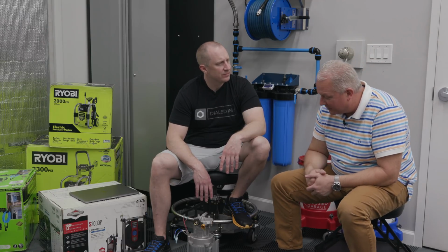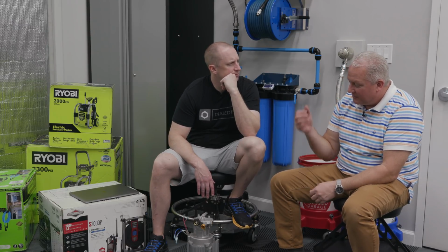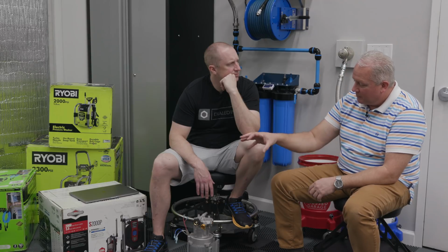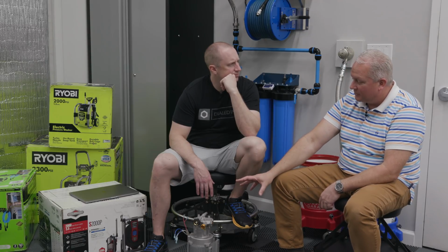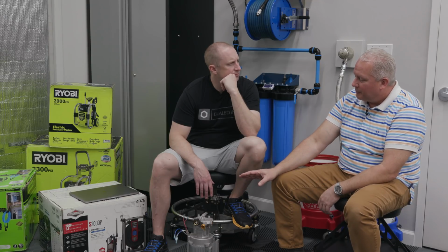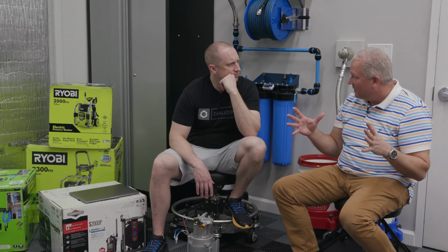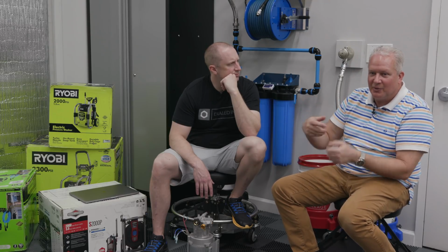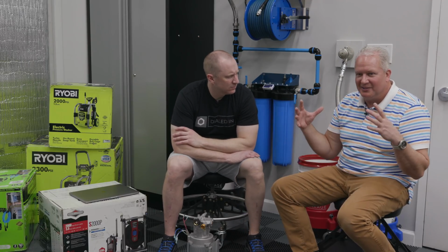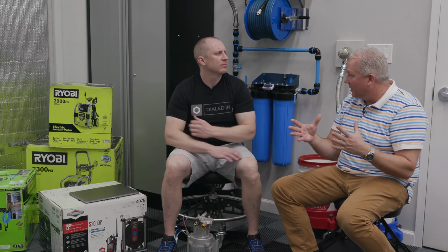Yeah, absolutely. It's a good segment talking about maintenance. You're selling a lot of the fittings, whether they're brass or stainless, and the hoses, but we do have an aluminum pump in a lot of these cases, and a lot of the fittings might be aluminum or brass. So it's important that when you're done using a pressure washer, you disconnect everything. A lot of times we just take the hose, throw it over the top of the unit and stick it in the garage. But you have all that water trapped in the hose, the fittings and even the nozzle, and water sitting in aluminum is going to cause corrosion over time.